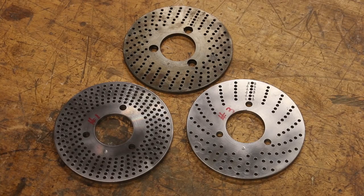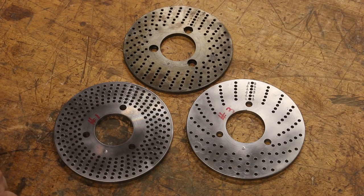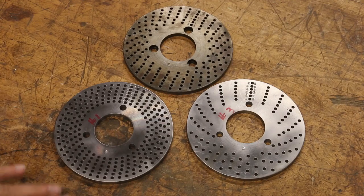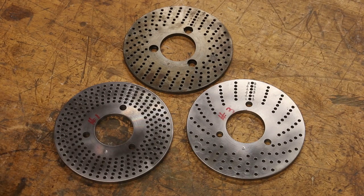So the game plan now is we're going to take this back out to the machine shop and re-drill the three holes on the proper hole pattern. Hey, we'll call this a feature — instead of a mess-up, these dividing plates can now be used on two different bolt patterns! That's what I'm going to keep telling myself. But we'll re-drill these out on the right hole pattern, then counterbore them, and everything should be good to go. We can completely salvage the situation. It is a little frustrating to have had a bozo moment and made a mistake like that, but hey, it happens to the best of us — and at least I can salvage these and don't have to start over.